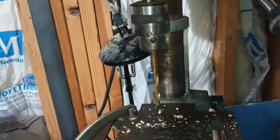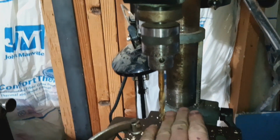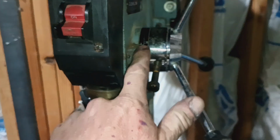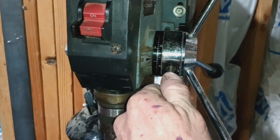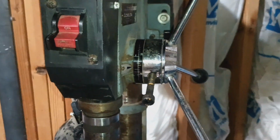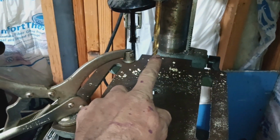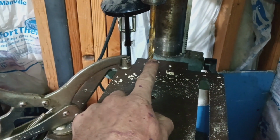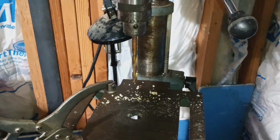leaving that 1/4 inch, because if the workpiece is too close, you run the risk of damaging it when you're getting it into position. So I would just always add a 1/4 to your measurements, plus 3/16 because the gauge is off. Hopefully, in your case, your gauge is accurate. So all you'd have to do is add a 1/4 to whatever depth that you want to drill, unless you feel like being risky and starting your hole with your drill bit touching your workpiece and scratching it all to hell. So hope that helps somebody.